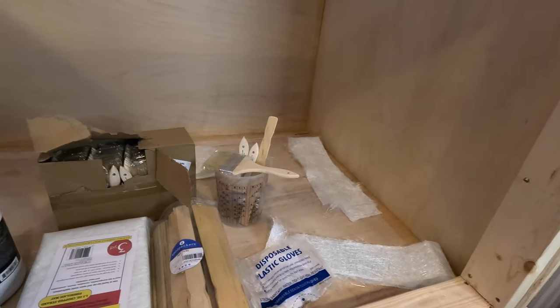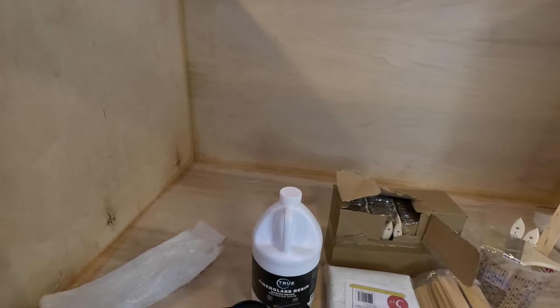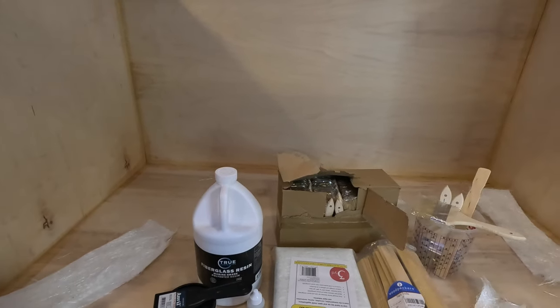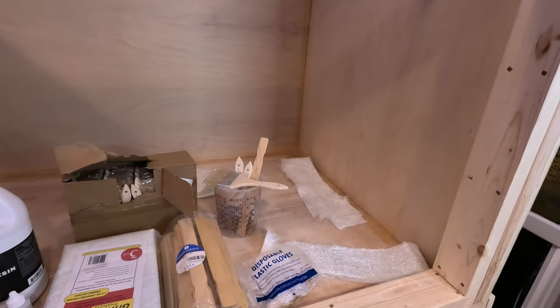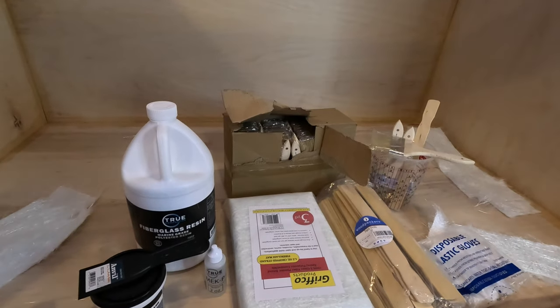And we're gonna do the same thing here. If we do our fiberglass work right, we're going to save ourselves a lot of effort on the next stage when we're painting the pond shield, which is super important because that's the stage where the waterproofing really needs to be done right. So you want to have that solid fiberglass behind it that was done well without imperfections. All right, now getting back to the materials.